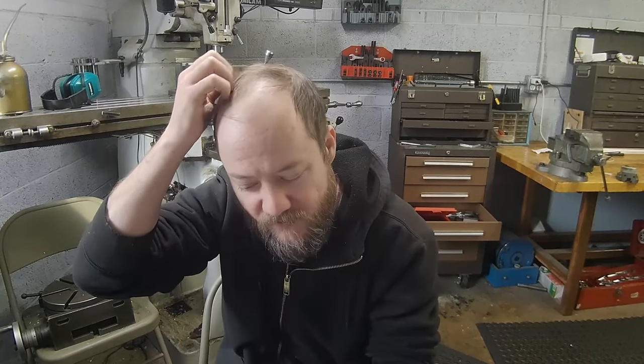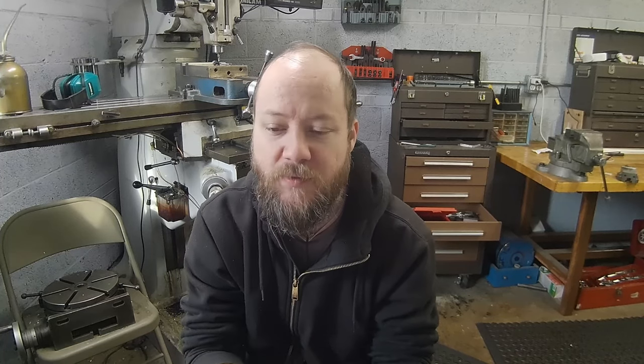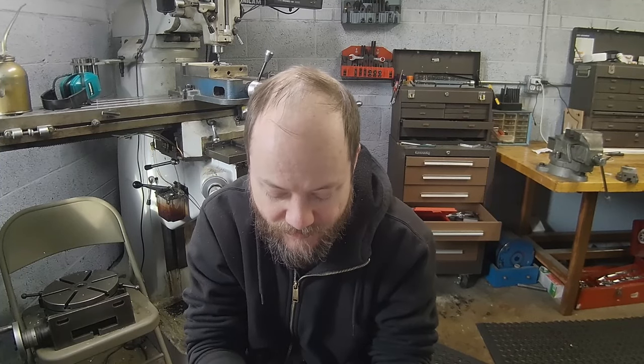This is 360 brass, which is a leaded engraver's brass. It's pretty critical that you use the leaded brass, because brass is not easily machined if you don't get the leaded variety. The leaded variety is available in fewer sizes and shapes and it's more expensive, but you can still get it. It's really good for making printing plates and stuff. As long as you don't eat it, the lead is not a big deal — it's like 2% lead. So we're going to square up the stock and then cut the design into it.